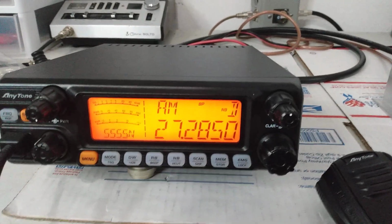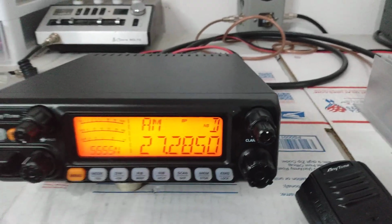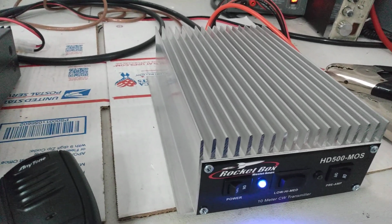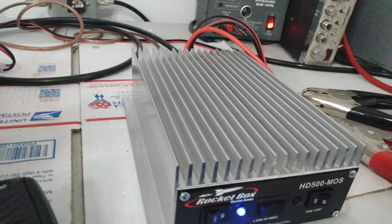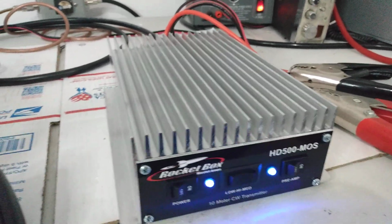But we're gonna be a little careful. We're going to swing probably a little bit less than this thing calls for. Probably closer to 75 watts PEP going into it. And then, like I said, we'll test it on sideband, see how it does. So we may be underdriving it a little bit. But again, just be cautious. Don't overdrive them. Preamp on this switch here.